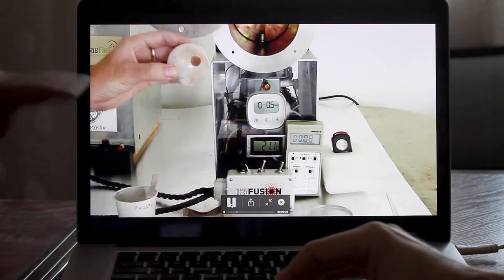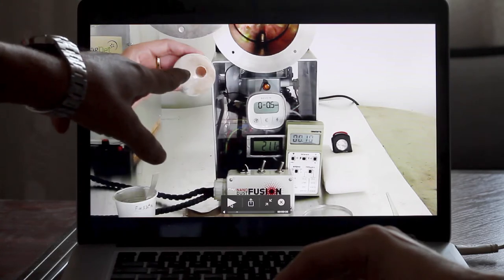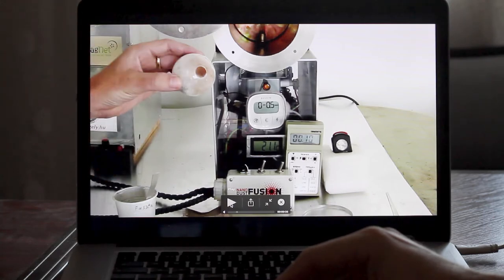Which is quartz. One big hole is visible there, roughly 15 millimeters in diameter, but at the back you have another hole of 10 or 8 millimeter diameter, because if you have just one hole, you have one frequency, but if you have two holes, you get a beat. So you're creating two overlapping frequencies; are they harmonically associated, or anharmonic so that you have a moving beat? But in nonlinear mediums like plasma, you have not only the sum of these, but the difference of these frequencies.